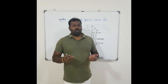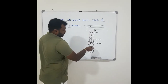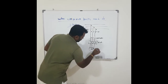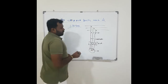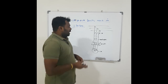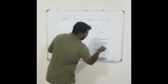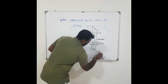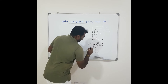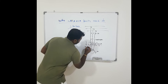So what is overcurrent and what is a short circuit? When current is flowing and the motor is running, if any mechanical jam happens on the motor side, the motor will slowly draw more current — more than the full load current. In this case, the overload relay will sense it. For example, if the motor takes 5A, we set the overload relay at 5A. But during a fault, it may flow 6A or 7A.